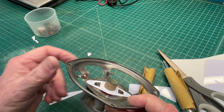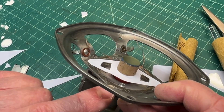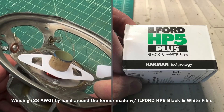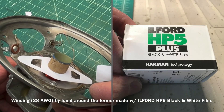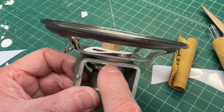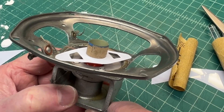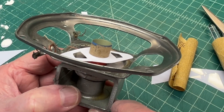This particular voice coil — the best I could actually wind it — is about 2 to 3 millimeters taller than the plate itself right here, so I need a couple millimeters above and below.